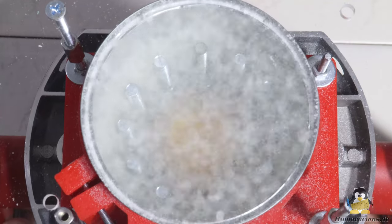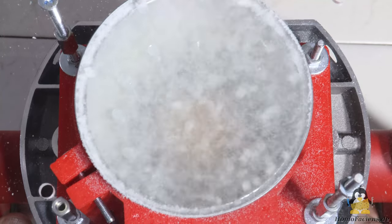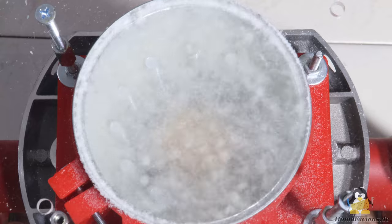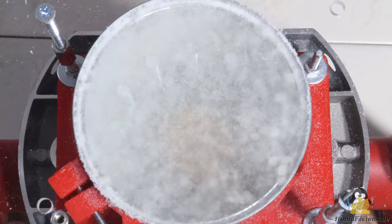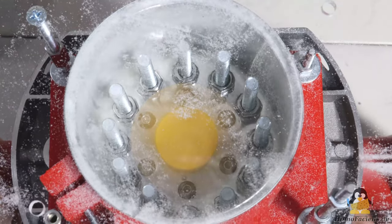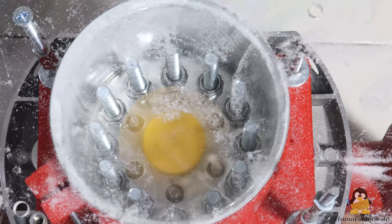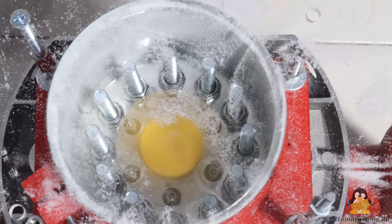Let's put a transparent lid on the can and take a look at the grinding process. You can see that the pellets are flying around wildly. That random movement of the pellets has a cooling effect — the plates do not always hit the same spot on the same particle; instead, a new, not quite as warm particle is always ground up next. It should also be noted that the degree of filling has an impact on the degree of grinding. The can should neither be too full nor too empty. Especially when there is only a small amount of pellets in the can, so-called dead spots can be seen, which are places where plastic particles accumulate for some time.